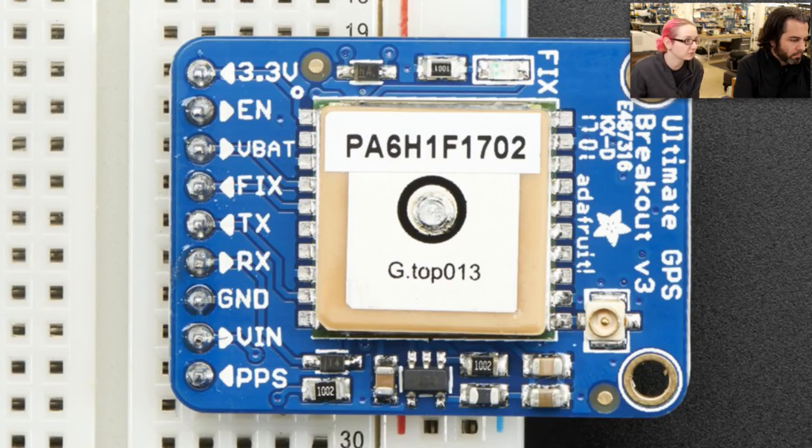The data sheet when it first came out didn't mention this. A later data sheet revision said you should put a Schottky diode to protect the battery. Never had an issue, but I wanted to do a quick revision to make the pads for the GPS stick out a little bit more, so we had less need for rework on these modules. While I was at it, I added that diode. Doesn't affect 99.9% of users, but it's there anyways.